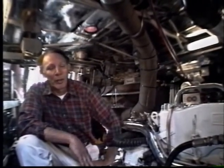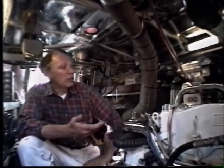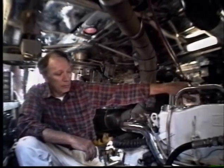Having a stop-start button right on the engine really solves some maintenance problems, especially when you're working by yourself. We make it a habit of starting the engine each time down in the engine room. That way I can come down, check the oil, check the water, have a look at the belts, look for chafe, and then just light the engine off when I'm ready.